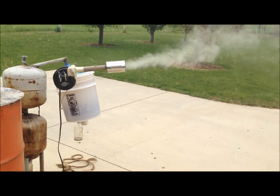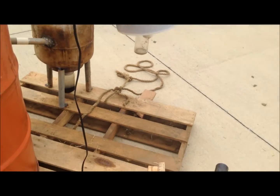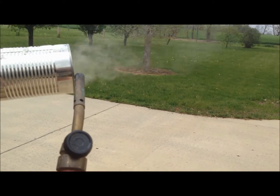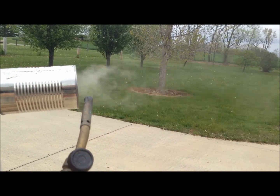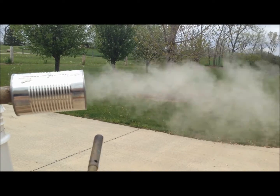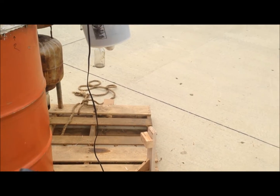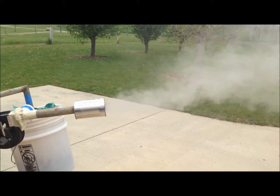Well folks, the gasifier has been going for about five or six minutes now and I'm starting to see liquid drip out of my blower - that's a result of getting rid of the radiator. What I have noticed is this very dirty syngas does burn - it doesn't stay lit, but it does burn. I hold the torch up to it and a lot of the vapor gets burnt and disappears, but when I take the torch away it stops burning. So I guess that's a sign that maybe if I had a stronger blower it would get hot enough, and if I had a good cooling system that got rid of all the water vapor in that gas, maybe it would stay lit. That's my next step, thanks for watching.